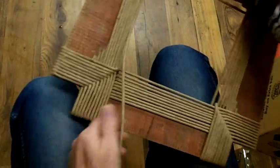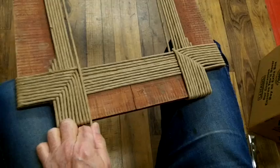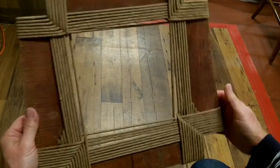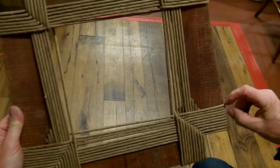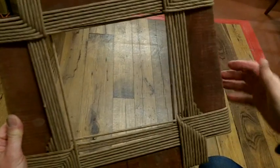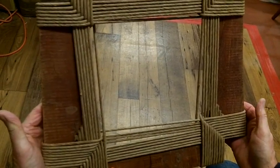I'm going to pull it out to the front, put a clamp on to hold the tension. Now we are weaving normal pattern chair. Remember, every 4 strands to take your wedge and hammer and make sure things are straight. You could do it even more often if you're having trouble with it.